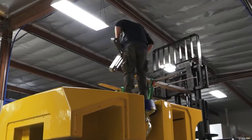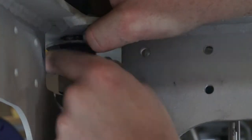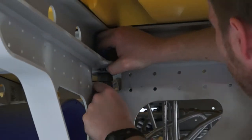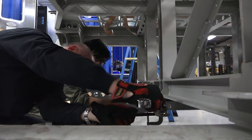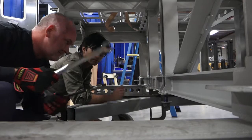The idea of this vehicle is that it's modular. If we mechanically fix everything such as welding it, then we can't get it off. So we've modularized the system such that the marine ops guy should be able to take nearly anything that's on his vehicle, take it off and replace it. That's why when you see anything being bolted — it's for ease of maintenance and replacement.